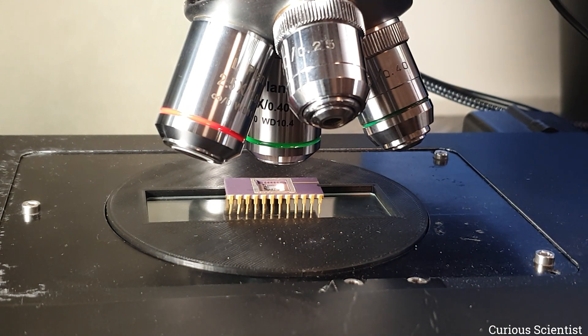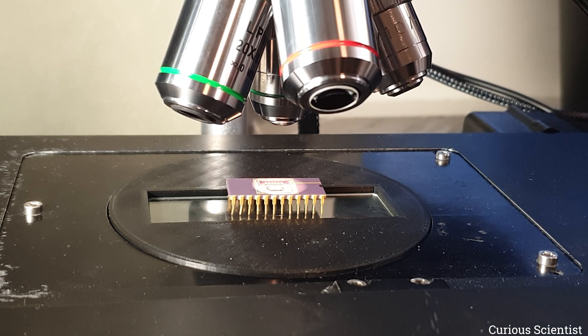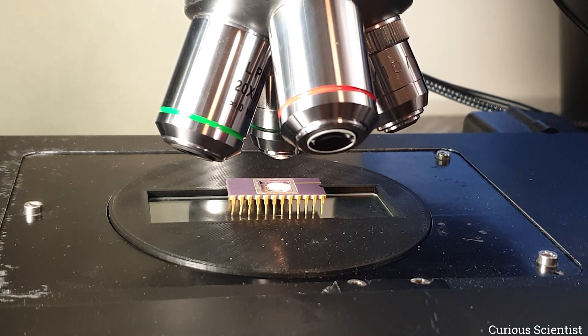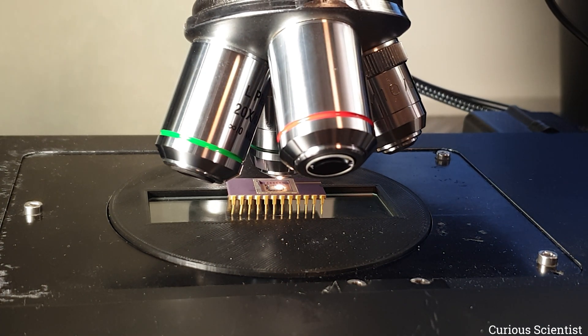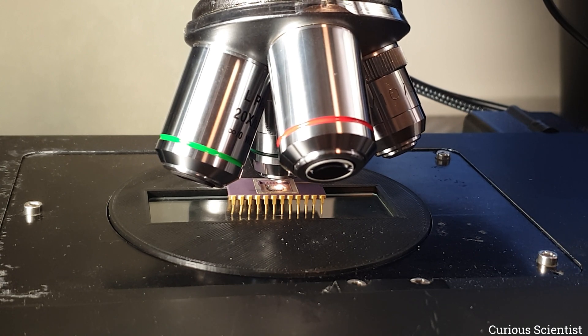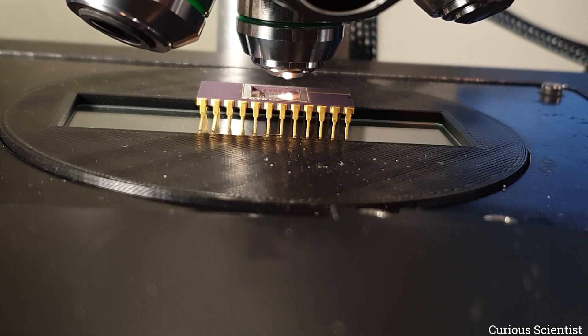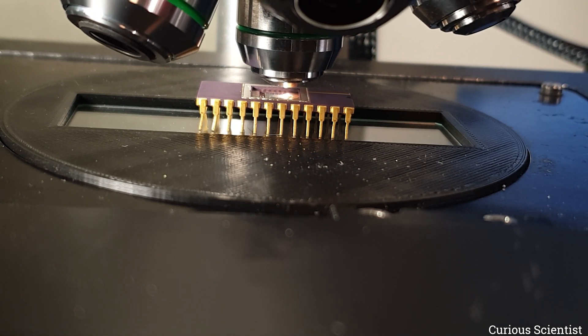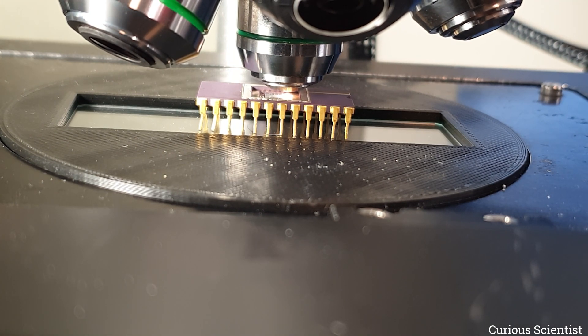So I'm still confused about the 2.5x lens — if anyone among the viewers knows why, please let me know in the comments. Now let's switch to the old 20x lens and see how close I need to get to the surface for a properly focused image. As you can see, the body of the lens nearly touches the package of the chip — this is where the long working distance comes in handy. I could not move my 40x lens here because it has such a short working distance that it would definitely hit either the package or the bond wires in the package. So probably the next investment will be a long working distance lens in that range of magnification.